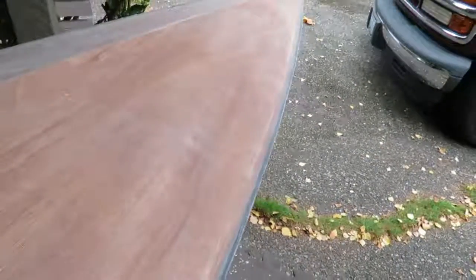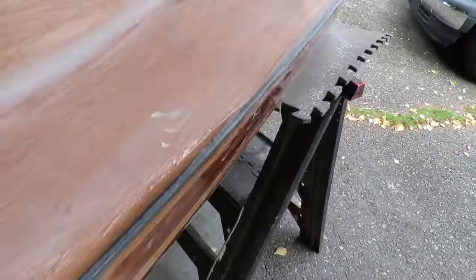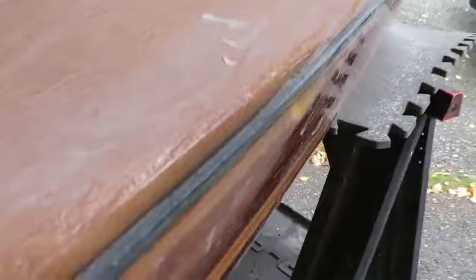Okay, now let's get up into the area that has been sanded. You can see how smooth all this is along here where it's been sanded with 180 grit. I didn't want to go coarser. It would have been faster with coarser, but I didn't want to go coarser than 180 grit because I didn't want to scratch and have to sand out scratches up in the deck surface area up in here. So 180 is doing it, and then I'll go over it with 220 and smooth out the 180 scratches. But quite a difference. Here's, again, the unsanded part, and you can see how the light reflects off of that in kind of an irregular way. So bumpy in here and irregular everywhere.